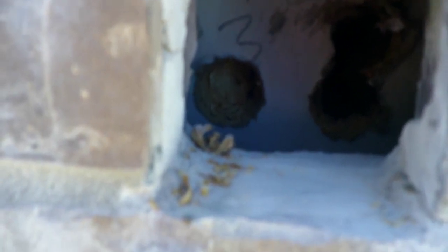Alright, so I'm not sure how well you're going to be able to make this out, but basically I've taken a paddle bit and drilled a few holes back here. I found that the stud is right in the center of where these two holes are drilled, and then I got a hole directly above that with the paddle bit. Basically what you've got is the studs, which are sitting like this, and then a piece of plywood on top of that, and then this gray weatherproofing material on there, and then you'll have some spacers.